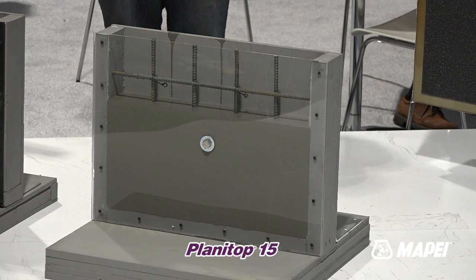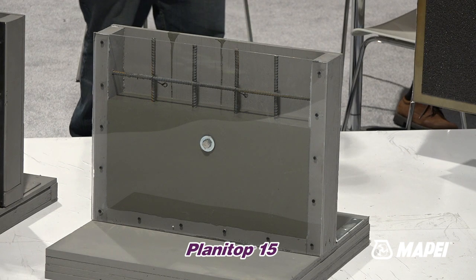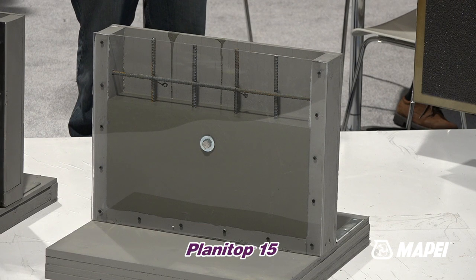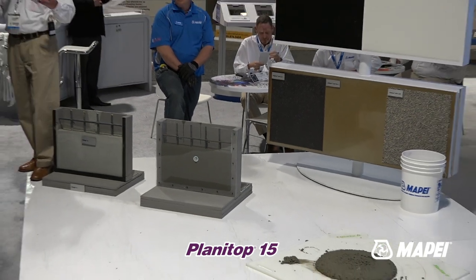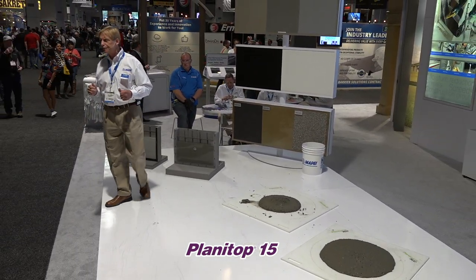The other thing is there are thickening agents within that keeps that aggregate in suspension. So when you look across here, you don't see small sand or larger sand pushing out through there. So everything is uniform, unsegregated, and a beautiful way to do form and pour structural repairs.